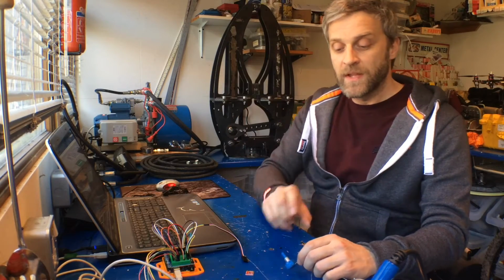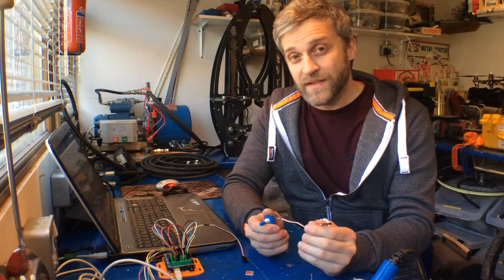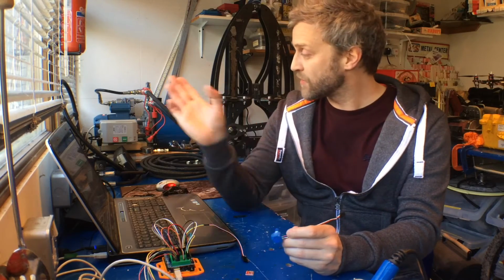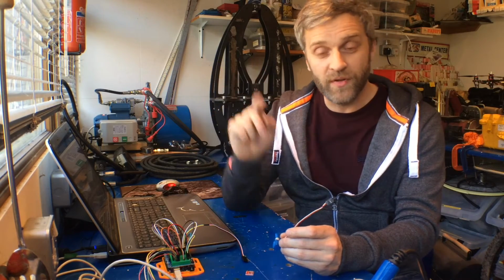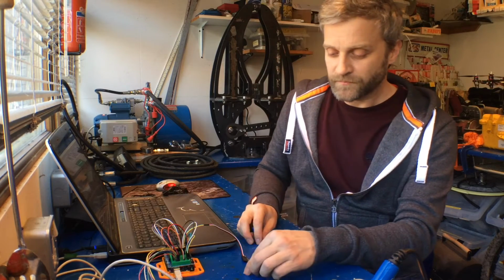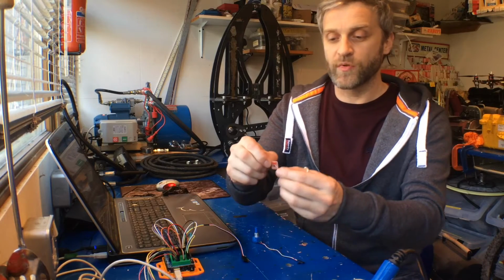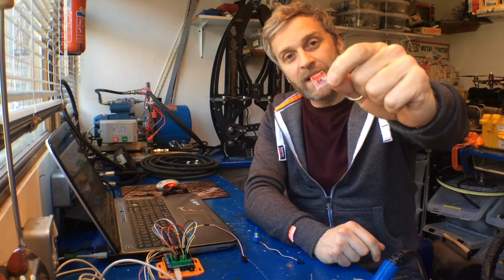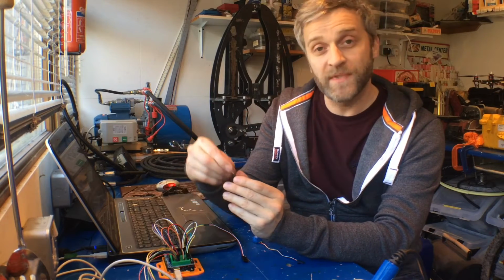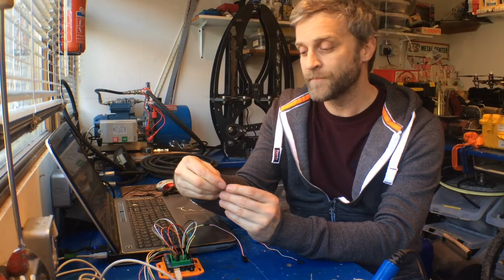So the next thing to do is basically add the control side of it, so I can talk to the special hydraulic valves that will close the loop on the gripper. Now to do that, I've got to add a few things to the Arduino. One of the first things I'm going to do is, I've already installed it on the board there, a little tiny device, a little digital to analog converter. It's based on the MCP4725 chip, which is a microchip device.